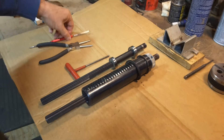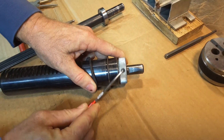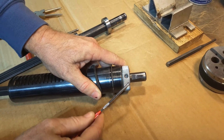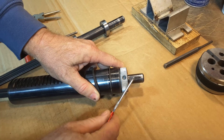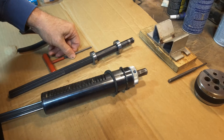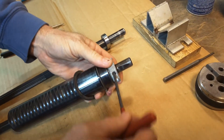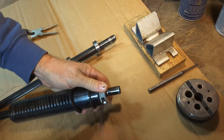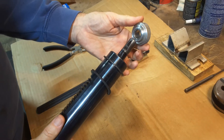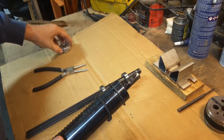You might need to dig out some putty that is on top of the set screw. A lot of quills have putty there so people don't accidentally remove this hub when removing saw arbors and things like that — that's what the dental pick is for. Then your standard 5/32nd Allen wrench will loosen that set screw, and usually you can just twist it right off. There might be some burrs to make it harder, but it should come right off.